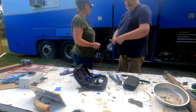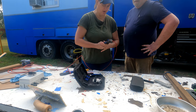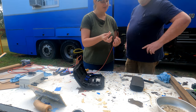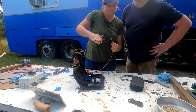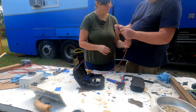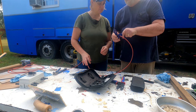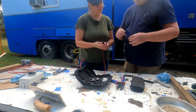You can still do the females. I'll talk through it: bump it up against here, go as hard as I can — it's automatic. Take this off and thread it in. Take one of the female pins and insert it there, then just squeeze away. There you go — did better than I did! There's a little trick: when you're putting it in, there will sometimes be an audible click or just a feel. These wrenches are specifically made for this — slide on and turn until it clicks. That's actually the wrench slipping on, and then you know it's in. Good job.